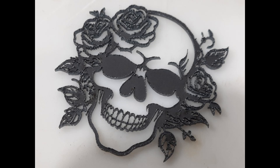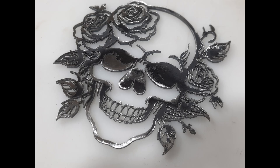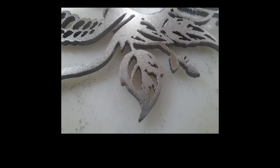Here's what the dross looks like on the back side. I was reluctant to take the dross off, but I figured let's try it. There is a lot of dross, and some features are very small, so I thought using the flap disc might break them — but it didn't break any of it. I used an 80 grit flap disc to remove the dross from the back, then hit it with 120 grit sandpaper on a random orbital sander, and it cleaned up really nicely.